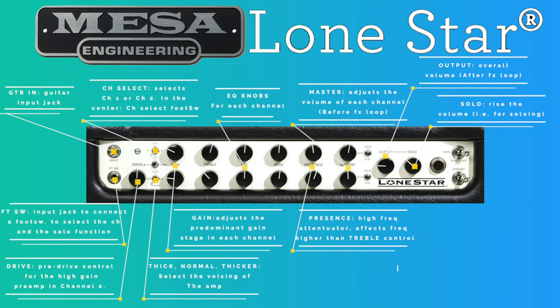Then we have a toggle for each channel to select the output wattage and style of power independently. In the 50 or 100 watt settings, two or one pair of tubes are online, delivering maximum power and punch from a circuit operating in class AB wired in a push-pull configuration. The 10 watt setting causes a complete reconfiguration of the power section — here we are in pure class A, which is far less efficient, producing more heat and less power, but with sweeter, warmer sounding clip characteristics that never sound edgy or harsh.